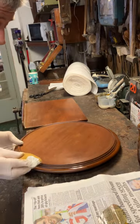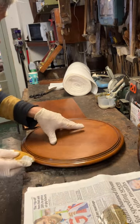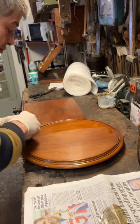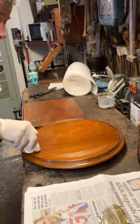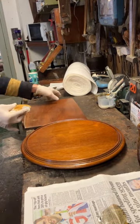To apply the polish it's very simple — just go around like this, and you can see it's looking very shiny the second you go over it. The reason it's matte before is because I put the polish on with a polishing mop, which is a brush, as you'd have seen in the previous video. I've lightly sanded it and then wire wooled it to get a great finish.